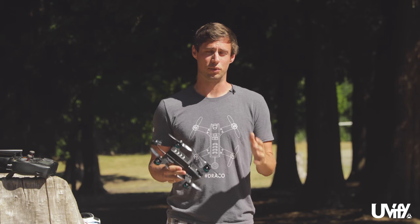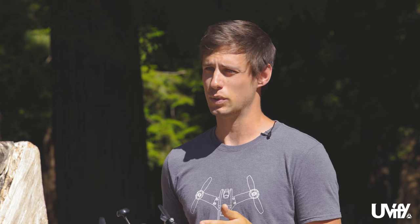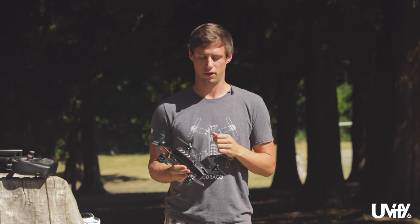Please make sure you have done all the previous setup — this is not right out of the box flying. You need to do some setup beforehand. When you're ready to fly, also check that your VTX channel and power output is within regulation for your country. For example, in the UK 25 milliwatt is the maximum output. In the US there are one or two channels that are illegal to use as well.